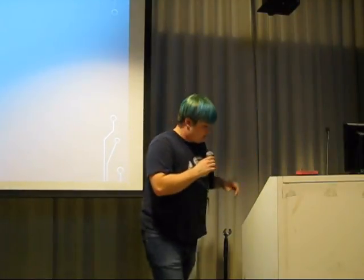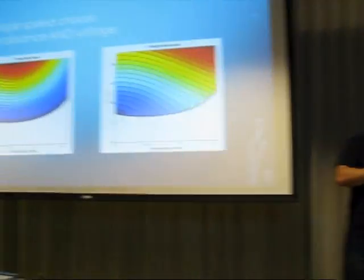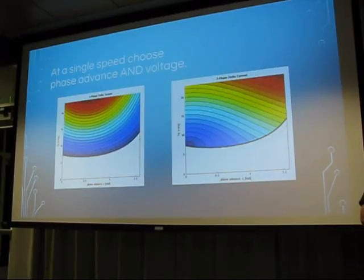But actually, I almost forgot. The next step, because we have a whole piece of hardware here, we know what angle we're at. We have a good estimate of what angle the motor's actually at, even though our updates are coming in at a kilohertz. We can do that next step that people are talking about a lot now with ID and IQ control, or field-oriented control. Did you have a slide from Albert? Yes, I forgot about that. One of our colleagues in our office is a real motor designer. There he is. He really understands the nitty-gritty of how these things work, down to the field level of what's going on.